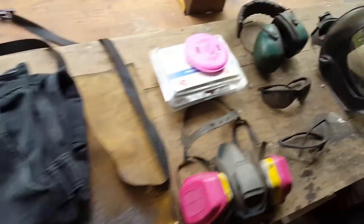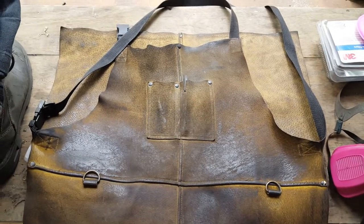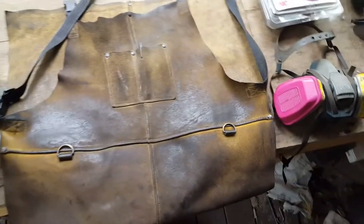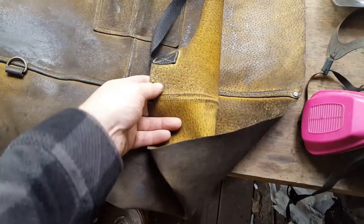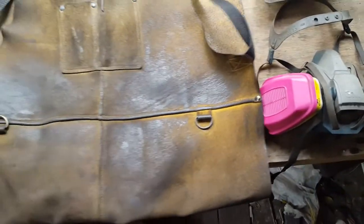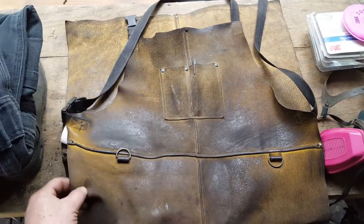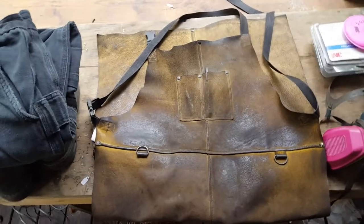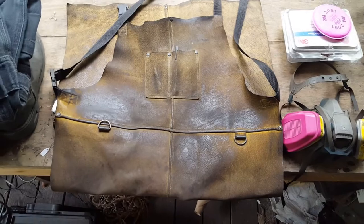When it comes to shirts, it doesn't really matter what you wear — t-shirts, long sleeve shirts — as long as you don't have very loose sleeves and it's not flammable material. This is my apron that I wear on top of all my clothing so I don't burn too many holes in it. This has also stopped its fair share of grinders and errant runaway power tools. It's actually made of split pigskin — you can see the little dimples in it. Look how thin this is. You'd think having something this thin is kind of worthless for protection, but that is not the case. It's every bit as tough as cowhide that's ten times thicker, but it's thin, light, and on a really hot day it's a lot cooler to wear. I prefer pigskin for everything from welding sleeves and welding capes to aprons.